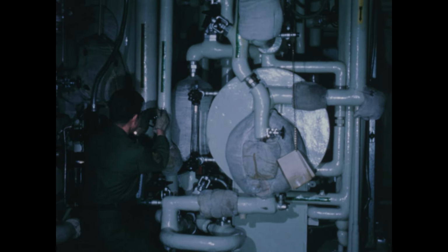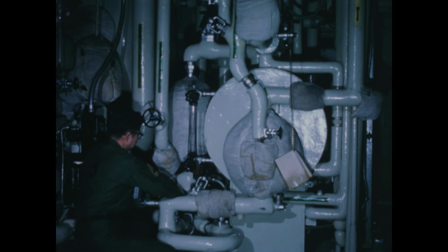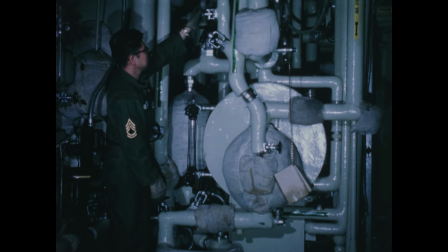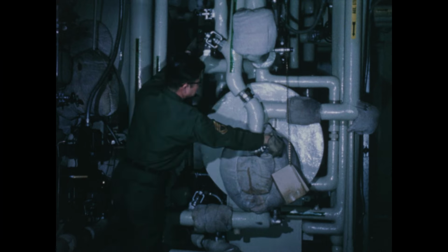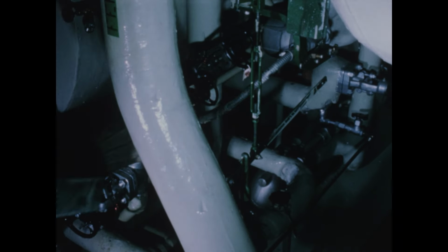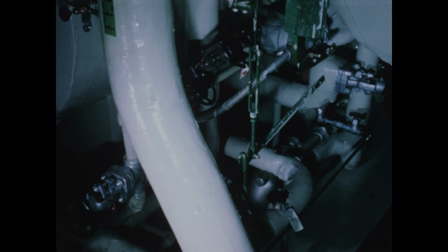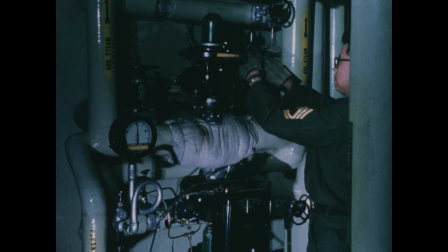When the plant water supply, held in the condensate storage tank, needs replenishment, the secondary evaporator is put into operation. The system is checked for a proper valve lineup. The evaporator feed pump is turned on. This takes water from the potable water tank and the snow melter.